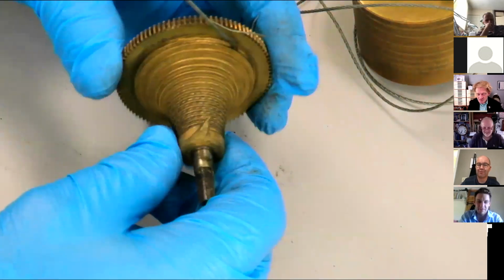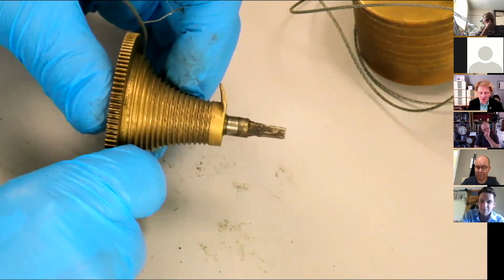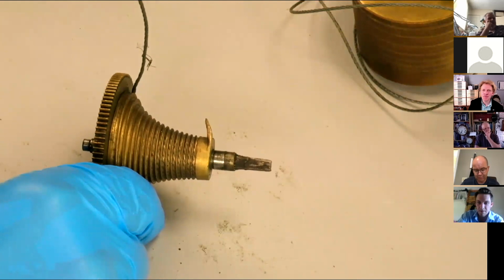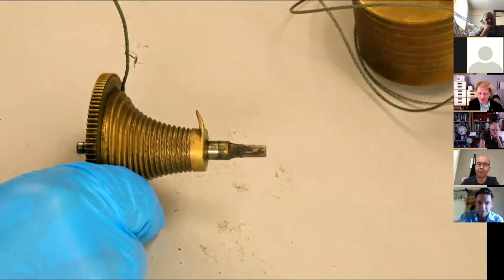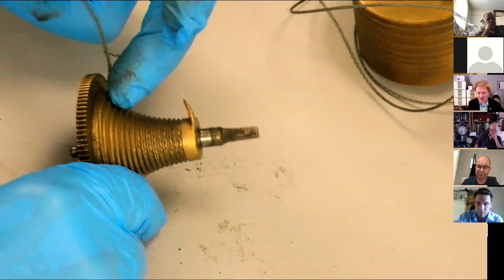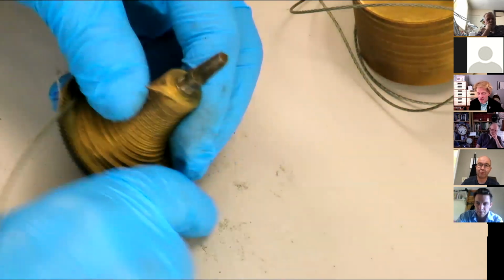So yeah, why have they bent over this piece at the end? Multiple reasons, I think. They didn't know about the relationship between the setup and the amount of line that needs to go on the Fusee cone. So they put a lot of setup on and then realized the spring was tight inside the barrel before it was fully wound. So rather than changing that, they bent this across. Maybe the mainspring's been shortened, maybe the mainspring's short and it won't fill up the cone. So who knows? We may never know. Somebody's hammered it round. Don't know.